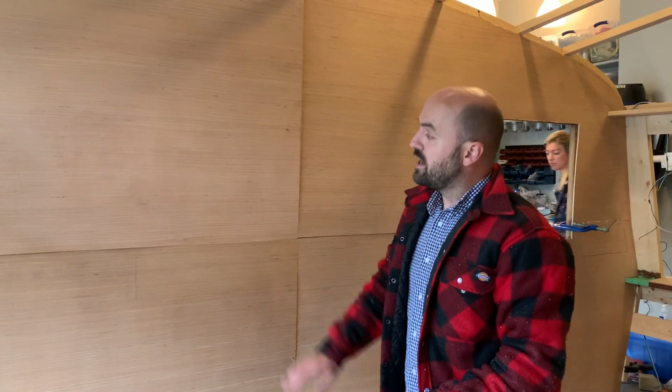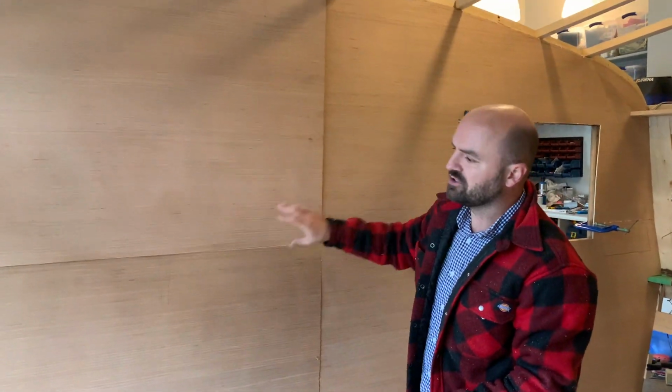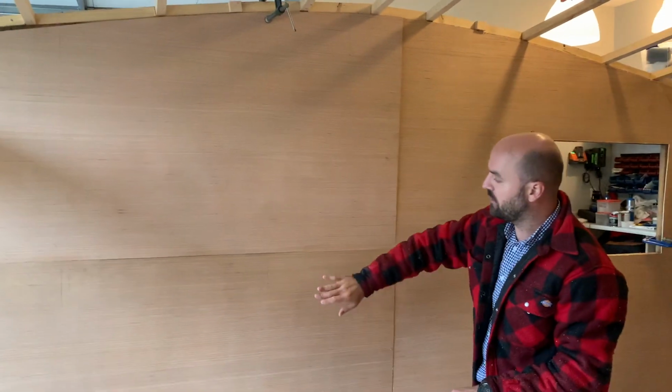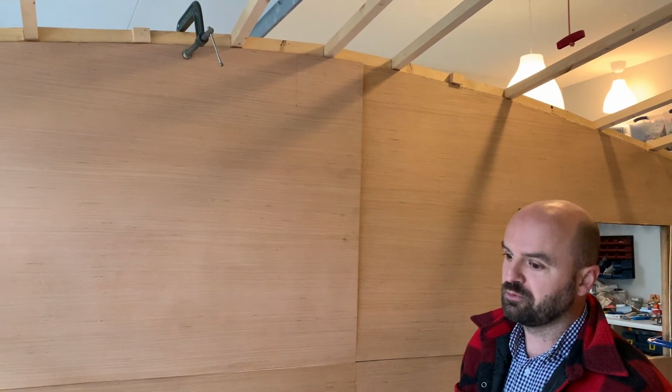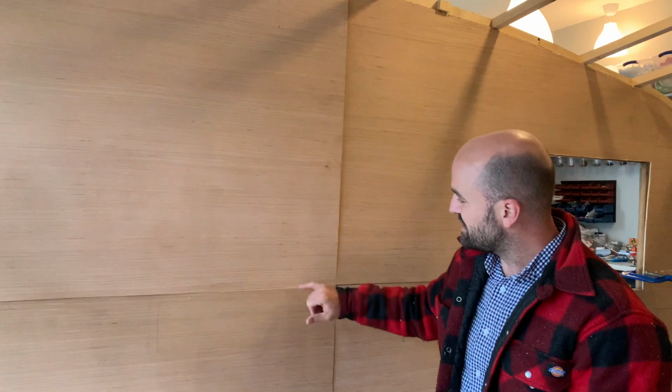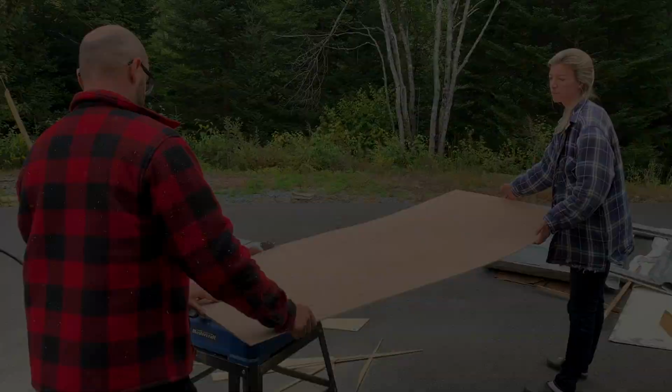We've been working on those walls. As you can see, I've made a cut on these panels. They're not attached yet, but it forms a complete wall. There's four panels. Cutting them was difficult just because we have a curve, and I don't know what tool you guys use for a curve, but we use a jigsaw, and it rips through the paneling, and it's just not looking clean. So now we're using the table saw, but it's kind of dangerous and not ideal. But there'll be a trim and nobody will know. I will know, but nobody else. I think they look pretty good. Just let us know in the comments.